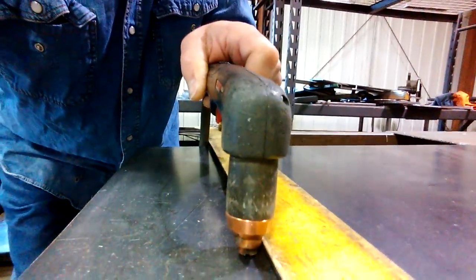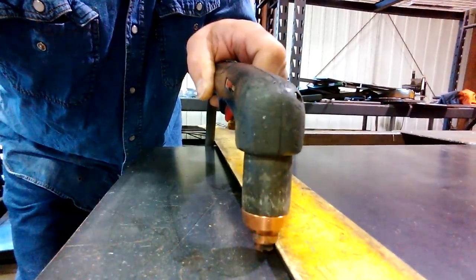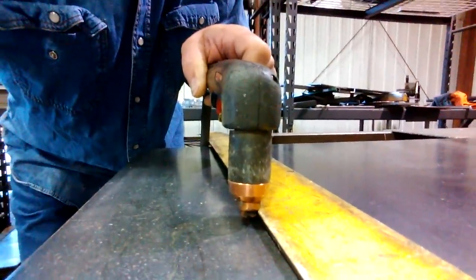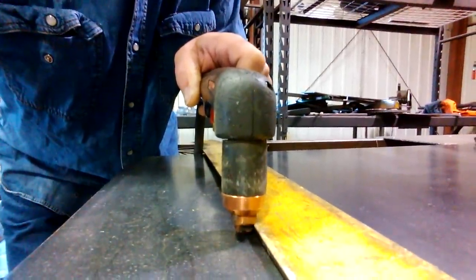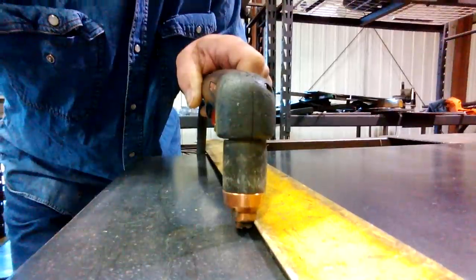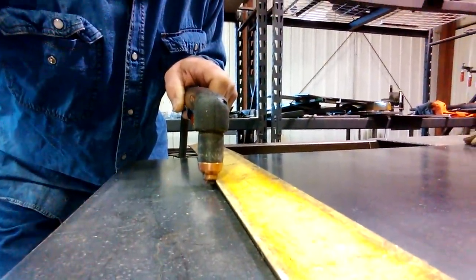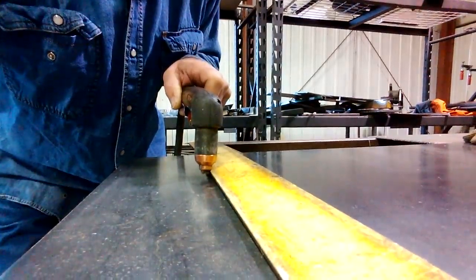This tip can make contact with the metal. So when you're cutting cook chamber doors or anything like that, you can use a good straight edge that you can bend, or like this aluminum one. Then you just start your arc and drag the tip down the edge of that straight edge, and you'll get a really good straight cut.